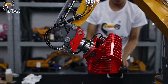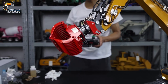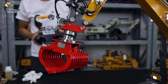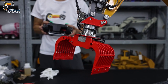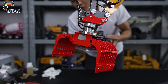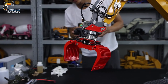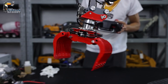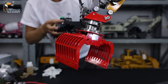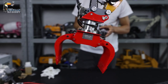We can now show a little about this grab. This is the movement — this covers almost all the parts. Turning inside, other side. Now we can open it by hydraulic. Let's try it a few times because we just assembled it. We can turn it — it's not 360 degrees but it's almost there. From this angle to this angle, it's around 270 degrees. That's how much it can turn.